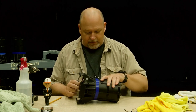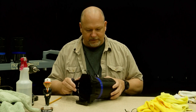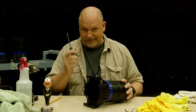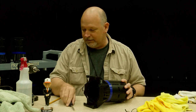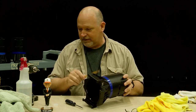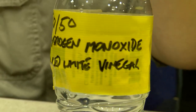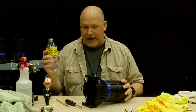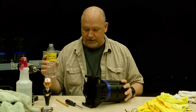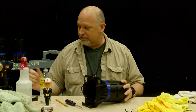Now what I'm doing — the 19s were easy to do assembled, the 36 is not so much. So you've got your lens tube here. You need some tools. You need a screwdriver — make sure it's magnetized. This one wasn't; double strokes across a magnet, now it is. Very important. A pencil with an eraser on it comes in handy on the G series. I'm using a 50-50 solution of dihydrogen monoxide — which is water — and distilled white vinegar, because after the hosing off we were left with some water spots and this takes it off perfectly. That's really all the tools you need.